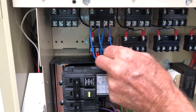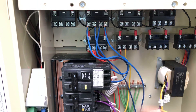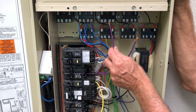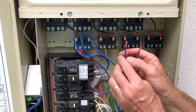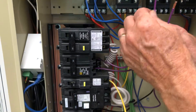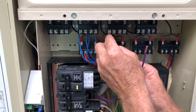We have these wired in and tightened down for the pool cleaner. Now we're going to proceed with the pool blower, using this relay for it. It's coming off the breaker for the blower — it's not GFCI protected because it's all by itself and not in contact with any pool water.